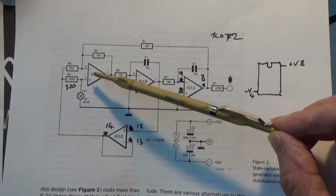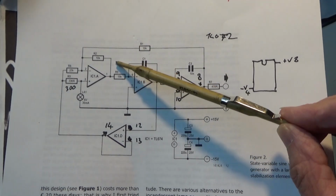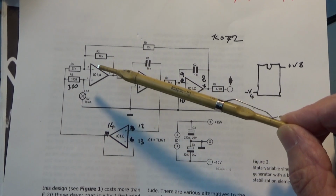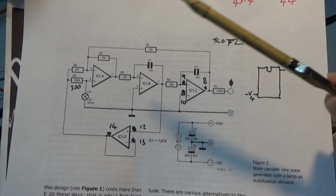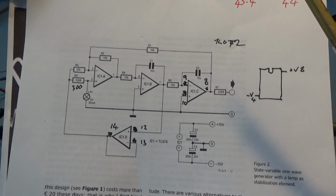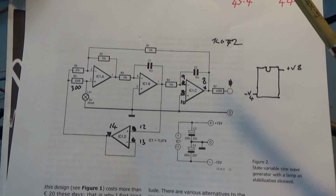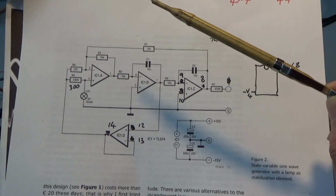So the resistance changes, the oscillator has to compensate for that, and you get a settling time until it achieves equilibrium. That's a good word. Equilibrium. And everything settles down then. And bulbs are very critical in this circuit. Somebody commented, use a 28 volt bulb. So you want something with a fairly high voltage with low filament current. Well, they're virtually unobtainable easily in this country.